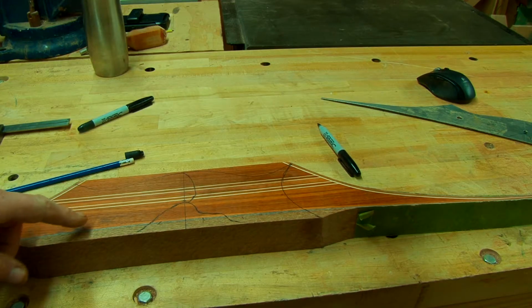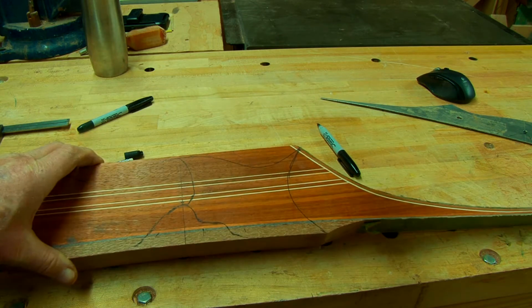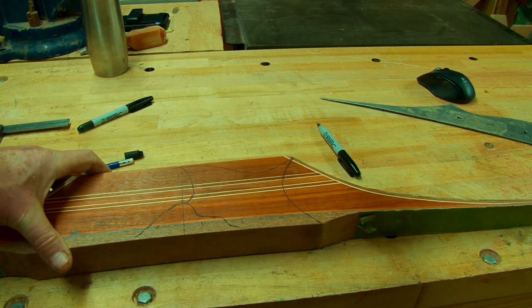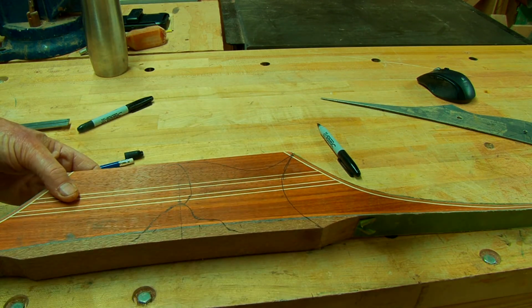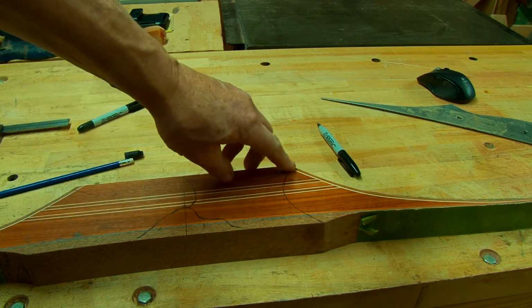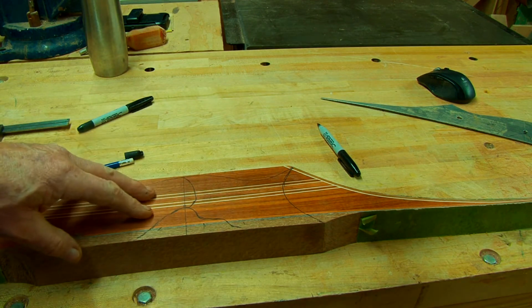You can see that the riser's here and the handle is right here. It doesn't cut deep into the thin maple lamination, stays on this side. And on the riser, I have a curved riser top here, which most commercial bows will never do. It's just too time consumptive. But I don't like the straight lines where they just bandsaw cut a window out of it. So what we're going to do is make this slope in, but also on a curve. So it's a compound curve.